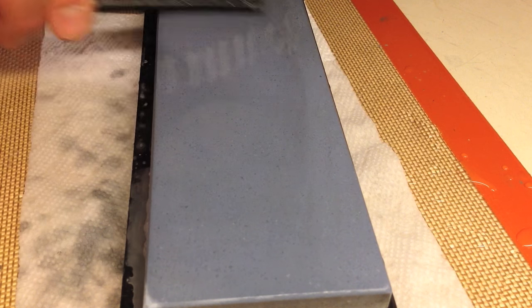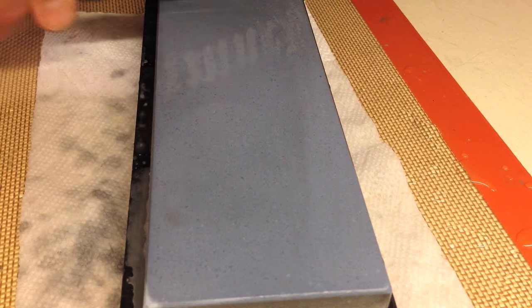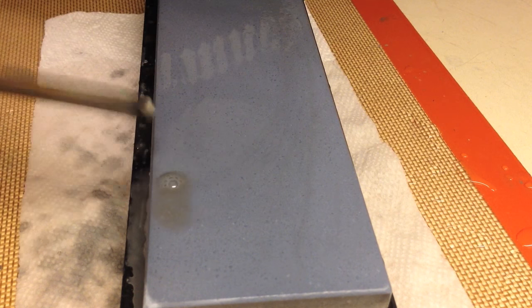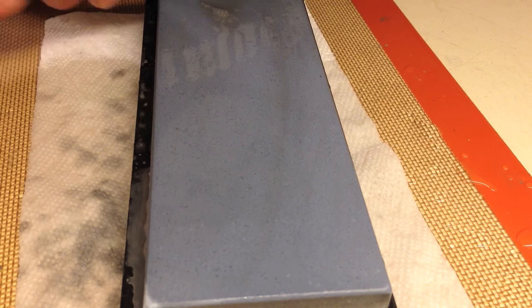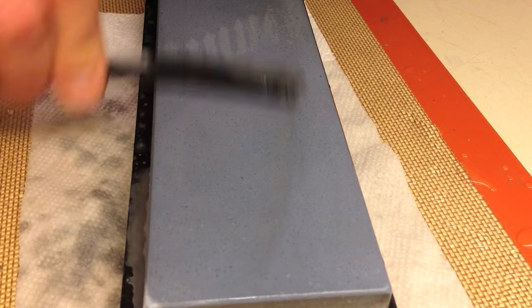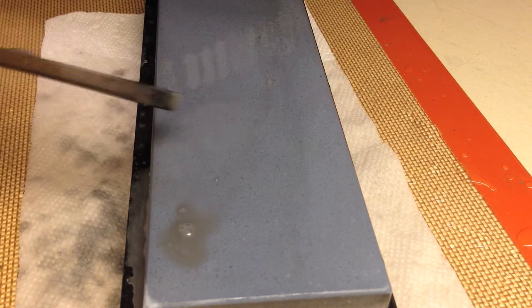It's one of the reasons I avoid a full hollow that has any noticeable devil spit or rust up into the bevel. I've had full hollows with rust going clear through the bevel - I can see daylight. It happened on a wedge too. I just had to hone, hone, hone over a long period of time. It's a nice blade and I had to lose so much blade width. It's just a shame.